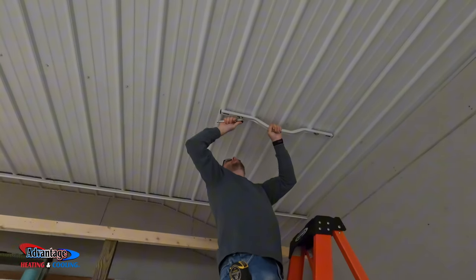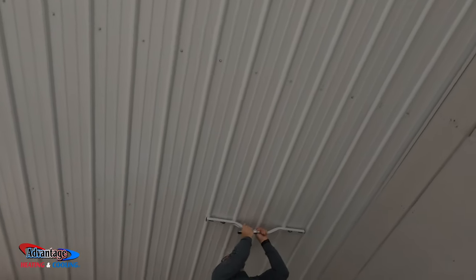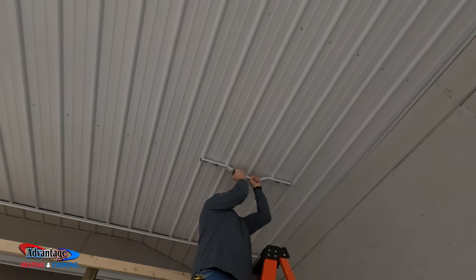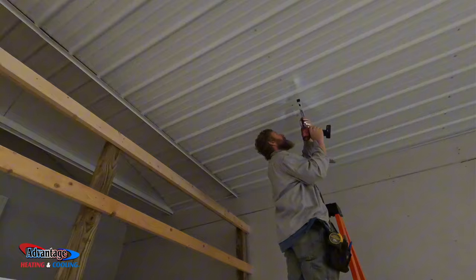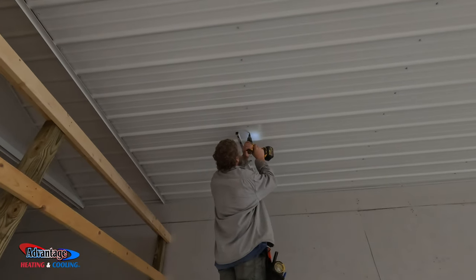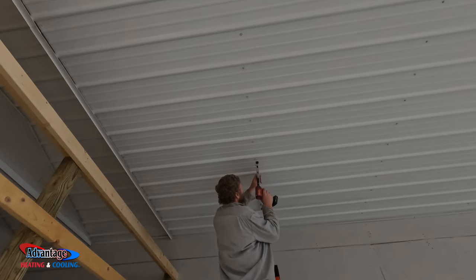That's freaking heavy. Is that going to feel a little loose? A little bit — yeah, it's moving the whole freaking truss. That thing only weighs 175 pounds maybe? So we're going to slide this over because these are four foot on center. This is off about a half inch, Corey — we're going to redo that to make sure we grab something. We can always angle it a little bit this way just to tickle. This will determine if we grab something and it stops.